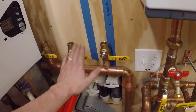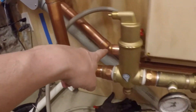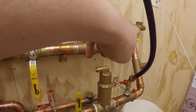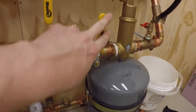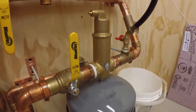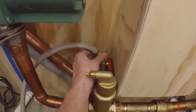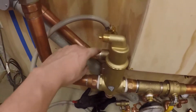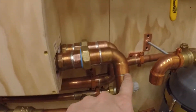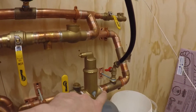I finished the return manifold on Friday/Saturday — everything behind here comes underneath, ties into the heat exchanger in the back, comes out of the heat exchanger, wraps around and stops here. What I did Saturday morning was attach a hose to this fill valve. I bled them a little bit, got a bunch of the air out, and basically filled the system through the heat exchanger all the way down around and out.